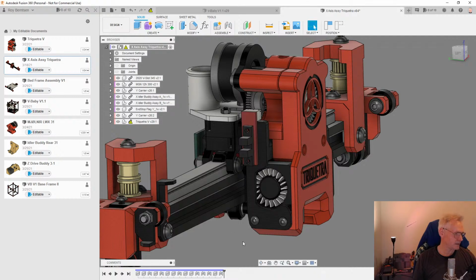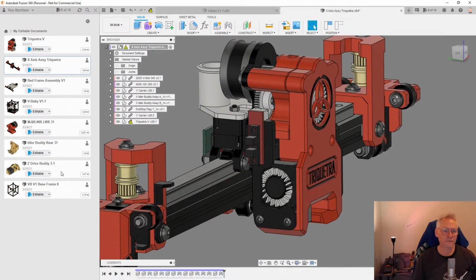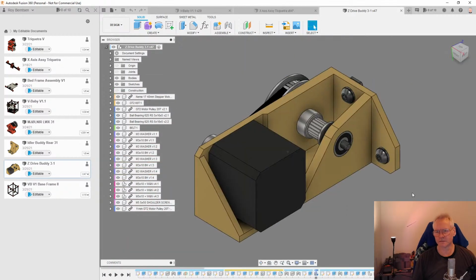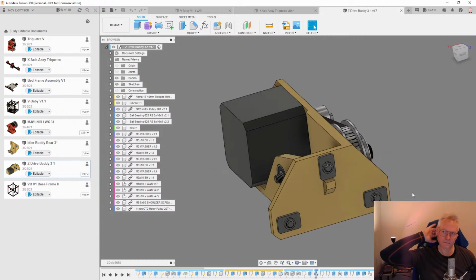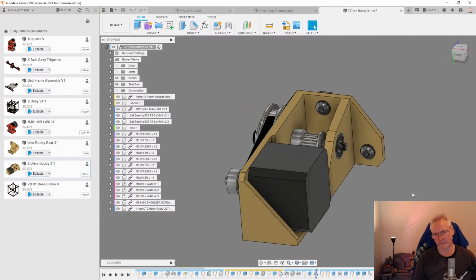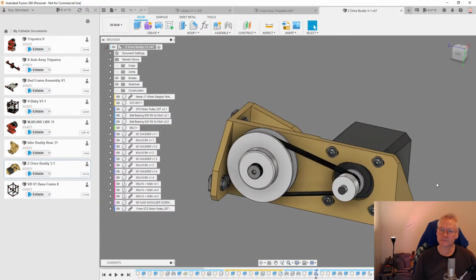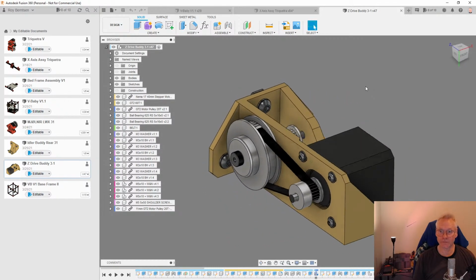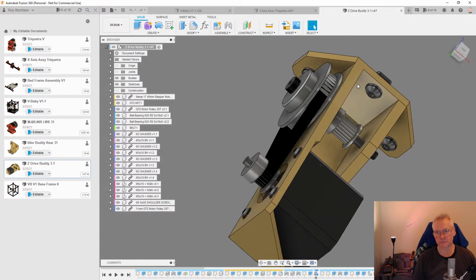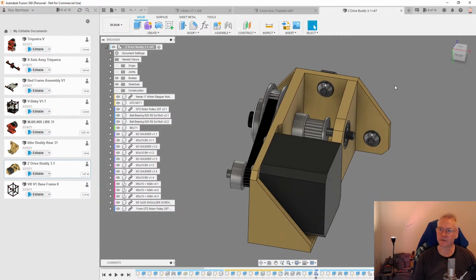So we're still waiting a little bit. And then we want to look into the new C drive. This is just a prototype, a work in progress. It's just something I want to test. Maybe a replacement for the worm gear. The worm gear works fine, so why should we change it? Well, there's also the price. This is a cheaper solution. And it might also be smoother than the worm gear. Less backlash, maybe?